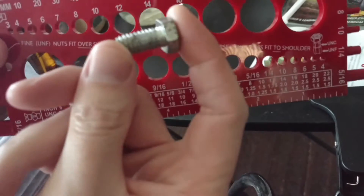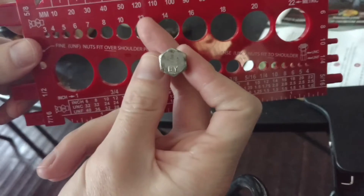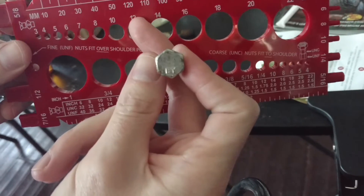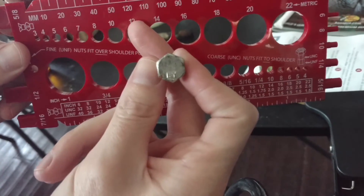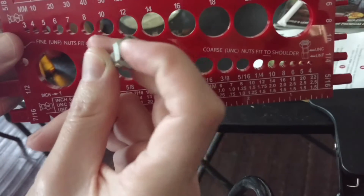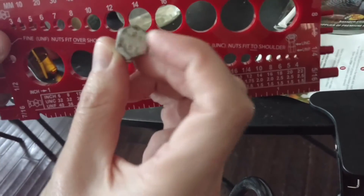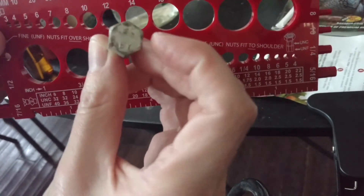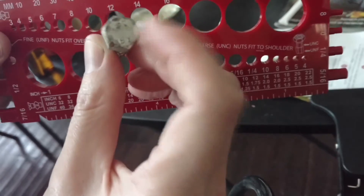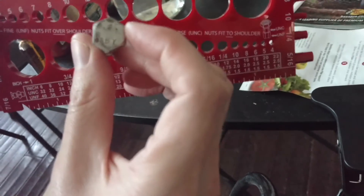Let's start off with an American bolt. The first thing you notice is the top. That 'BY' marking is probably a grade of bolt in the ASTM category. Since it doesn't have any slash marks on the top, we're going to assume this is either grade 1 or grade 2. Any slash marks on the top, you add to the number 2 — so if there's 3, it's a grade 5; if there's 5, it's a grade 7, and so on. You can look up the details of all the differences because it gets more complex.